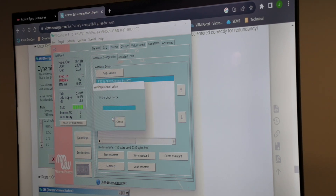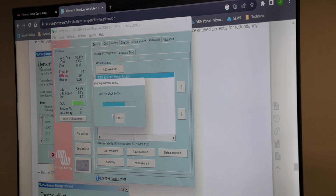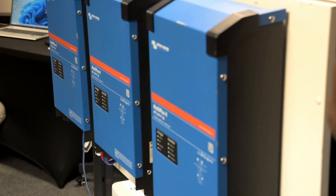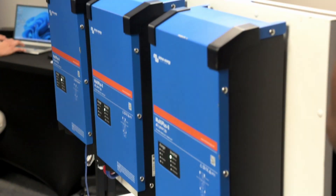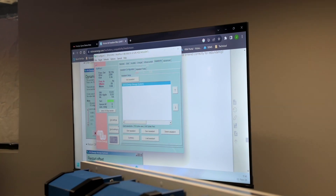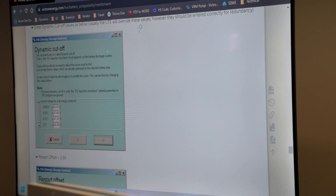Our sustained voltage is correct. Now it's asking us if there's a PV inverter on the output of this inverter — yes, we've got a three-phase inverter so I'm going to say yes. That's all it's asked — it just wants to know if that phase has a PV inverter. Click next and say send settings — modified settings to this device.